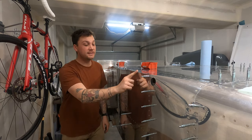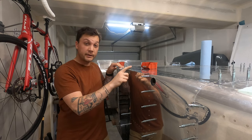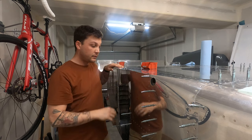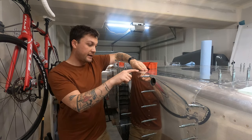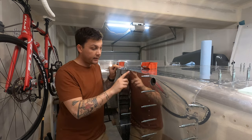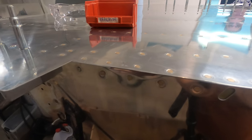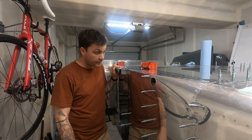So when riveting the skin here, we wound up with a slight bulge in the bottom skin, what is right now the top skin. And I carefully tried to work it flat with the rivet gun, just doing small passes. And I got it flat, to my credit, but I pushed it a little too far. And what happened is, with this skin butting right up against it, it had nowhere to give, so it curled into it. And honestly, I'm absolutely heartbroken.